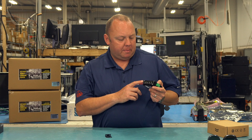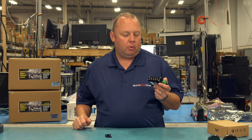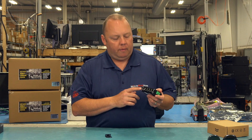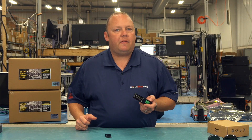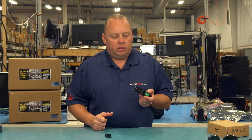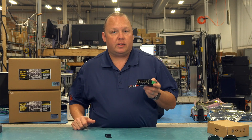This device has five gigabit Ethernet ports — typically four usable because one of them you're going to uplink to your mobile router or mobile internet setup, giving you four available ports. The converter inside here that takes the 12 volts up to 48 volts will provide up to 60 watts of power at 12 volts. An average access point from Peplink, like the AP One Mini, will use 12 watts — so 12, 24, 36 — you're fine to wire up quite a few access points and this will run.